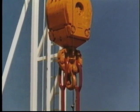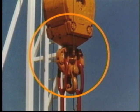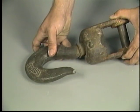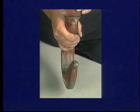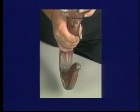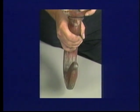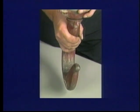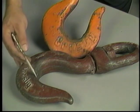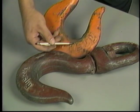Many blocks are provided with swivel load connection fittings including hooks of various styles, shackles, or eyes. Visual inspection of swivel fittings should include shoulder running clearance, lateral movement, wear, and deformation. The hook being demonstrated is a single point type. Regardless of the specific design of a hook, the maintenance rules remain the same. It's important to remember there is no substitute for regular visual inspection in the field as the first step in a good maintenance program.